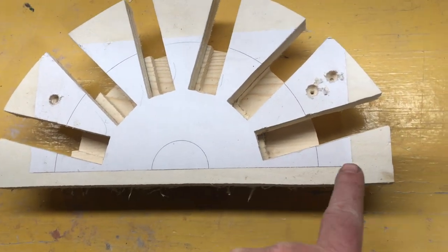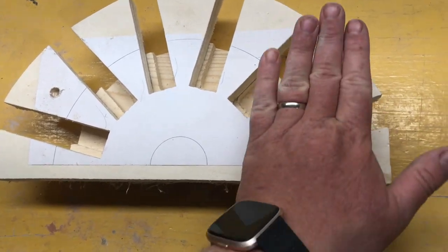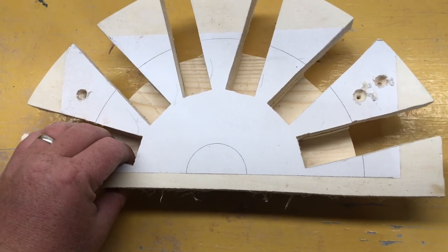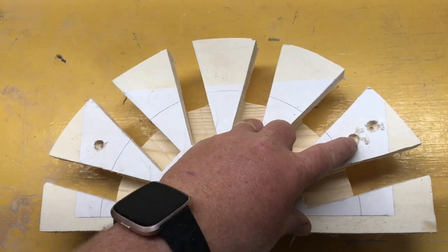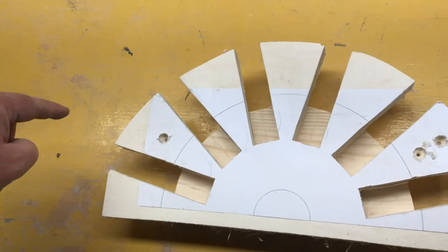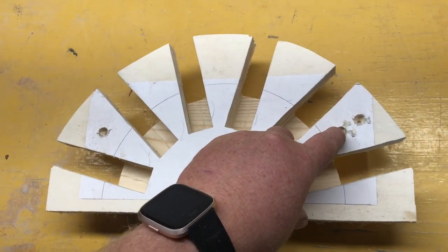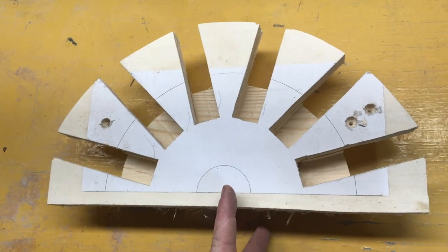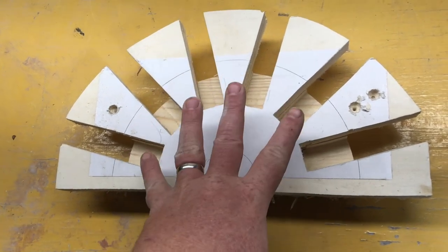And I did that. So when you see here, this is bigger because I wanted some landing for the router to sit onto. And then you set it up like this, so when you do your route, everything works out perfect. Now, these screws here are countersunk, and I just use drywall screws, because you have to imagine that the rest of the 2x6 is still there. These go in and hold it down, but it puts it below the level of the router. And then all I do is clamp here onto the actual piece, when I'm holding everything in place.